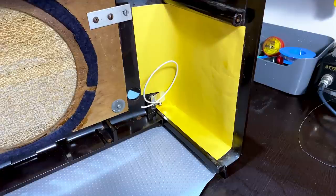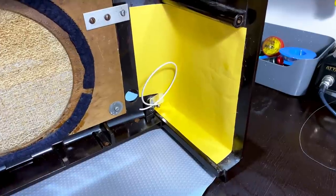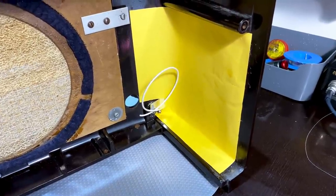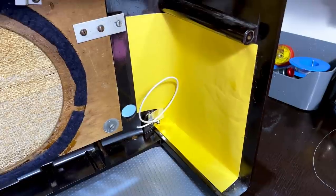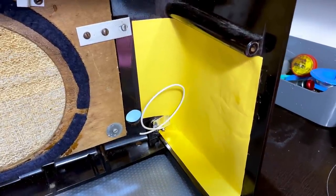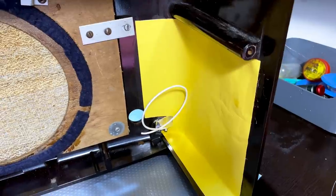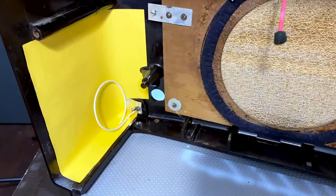I needed to create a shield on there. The others were completely kaput. So I got an old envelope. It's sort of thickish paper, not quite cardboard. Taped a layer of aluminium foil on the inside and connected that to that bottom end there where the little wire sticks out. That's going to be connected to the chassis. That's our ground. That's our shield. And of course, the other side is the same thing.